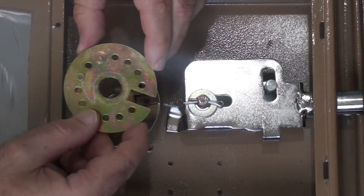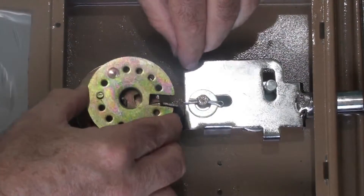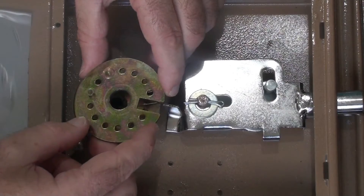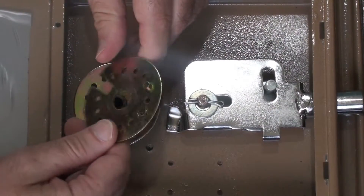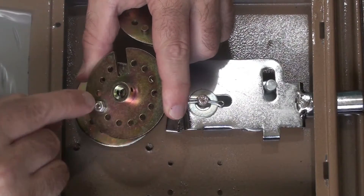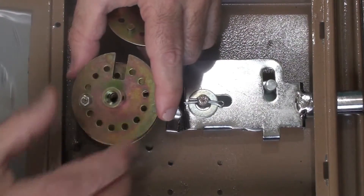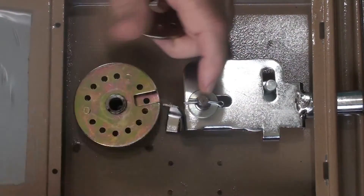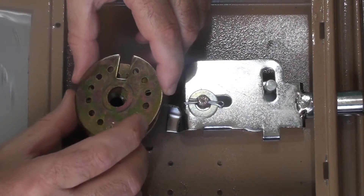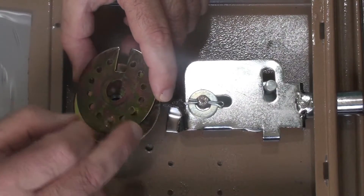You'll notice a few interesting things. First, the gates are massive — look at the tailpiece and look at the size of the gate. Not only are the gates massive, but there's actually no way of changing the combination. On the drive wheel you could move that pin to another position, which would just shift the same combination a few degrees around the dial. But as far as these other three wheels are concerned, there is absolutely no way to change their number.